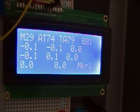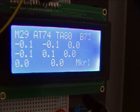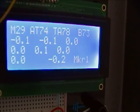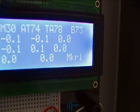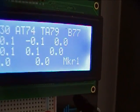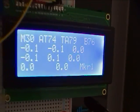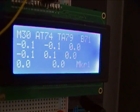That's the way my display looks right now. Upper left is minutes since I turned it on — 29 minutes. AT stands for ambient temperature, 74 degrees, and I've got three places for that. TA is temperature A or 1, reading 78 degrees, but I've got room for 9,999 degrees. I didn't want to use T1 because that would confuse the number. Then B is thermocouple 2, reading 76 degrees right now. The pressures start with 1 and move on toward 8.